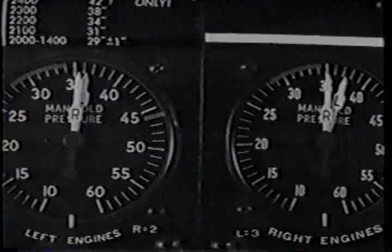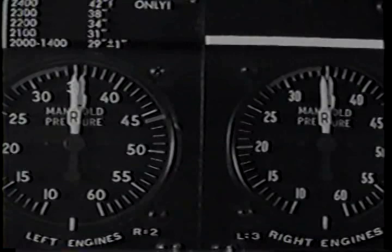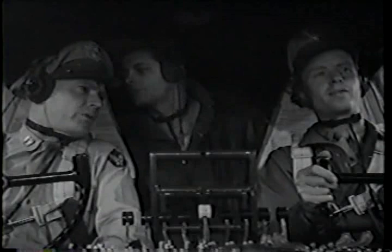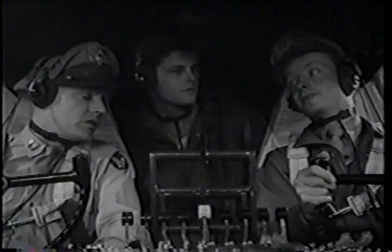With carburetor icing conditions, of course, you'd use intercoolers hot, but you won't normally get carburetor icing above 12,000. And up there, you'll always want intercoolers cold. Thin air means higher rate of compression from the supercharger, and compression makes heat. In the wrong places? Nearly always in the wrong places.